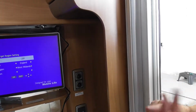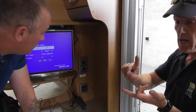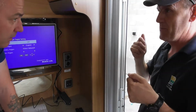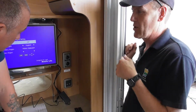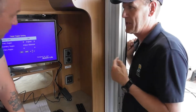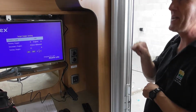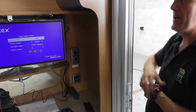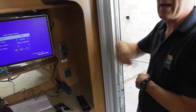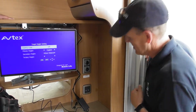Things you want to check then are, again, have you turned the gas on? Have you got any gas? So you could just light your cooker up just to see if you've got gas running. If you remember the cover on the outside of the boiler vent, take that off. Make sure that's off. Then the other thing is it's got air in the system. So same as your fridge, you may have air in the system, so you need to purge it out. So give it again 30 seconds to a minute to reset. Turn it back on again and see if it will light. If it goes to red again, it's failed. So turn it off again, give it another period. It all depends. If you haven't used it for quite a while, it may take 2 or 3 attempts to purge the air out. Okay, but otherwise, green light, that's okay.